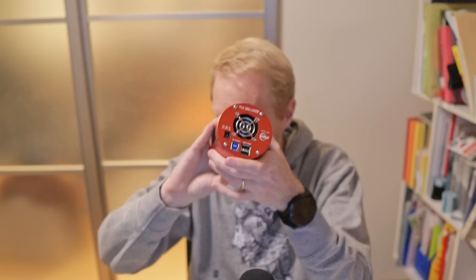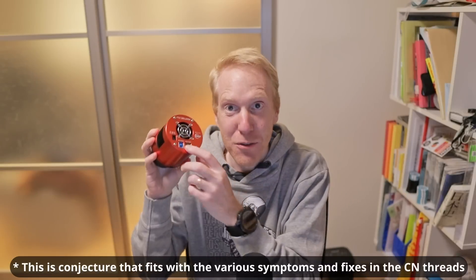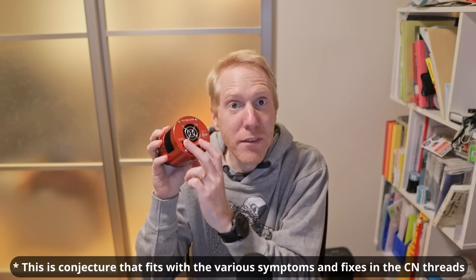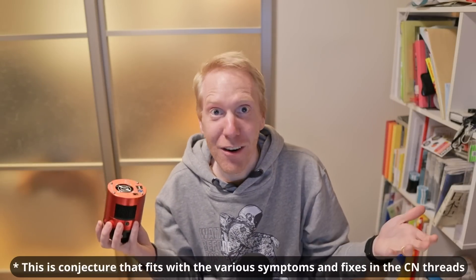What is happening is pretty simple. Cooled cameras generate heat to cool the sensor, and that heat needs to be dissipated actively with a fan. A fan is a moving part that can create vibrations if the design is not perfectly thought out. The typical ZWO design is actually not very good in that respect because the fan is connected almost directly to the camera casing, so it can resonate with it — just like a guitar amplifies the sound of plucked strings.